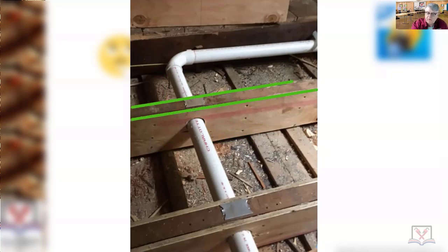So the plumber, on both sides — what do we call this board? Colin West: is it a gusset? Yes, that is plywood cut to the depth of the member, and gusseted it on both sides. Gusseting is not only about the nails or screws — it's also about the fastening: liquid nail, or whatever they used under it before they gusseted it on.